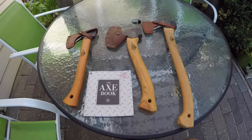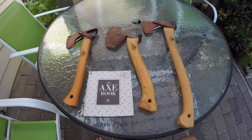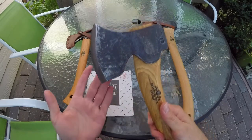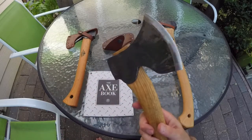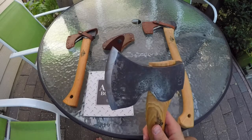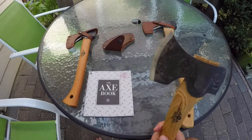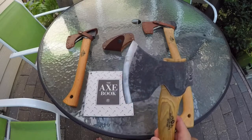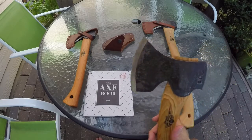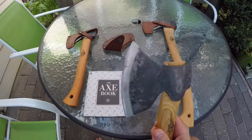That's the small forest axe — that's my two-hander. What makes this an axe is the fact that you can use it with two hands. This is a short one-handed tool, but it is an axe. This is the Gransfors Bruks Swedish carving axe. Just look at how beautiful this is — my inner Viking just made a battle cry. This thing is absolutely incredible. Very wide blade, upswept blade. I use this to actually wood carve with. This is a cross-cutting axe, not a splitting axe. It's used to hew spoons, bowls, planks, logs, whatever you need, and shape them very accurately. The reason you can shape them accurately is because of this very curved blade — you can really dig in and shape the wood how you want to.